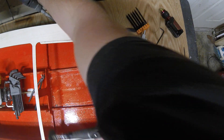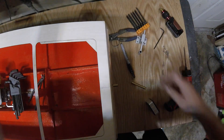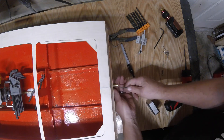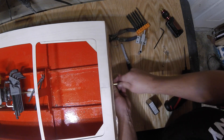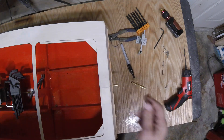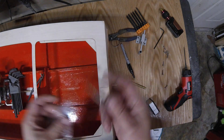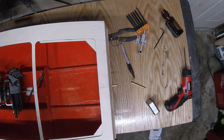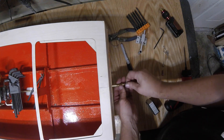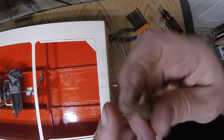So what I'm going to do is trim this with the Dremel. There's that cut-off disc — Dremel Easy Lock. Look those up on Amazon. Best thing in the world. Now what I'm going to do is file the inside a little bit. Another trick I do sometimes — I have a fluted step bit. I'm going to put that in there with the drill — you don't even have to use a drill, you can do it by hand. That will cut the edge out there perfectly.